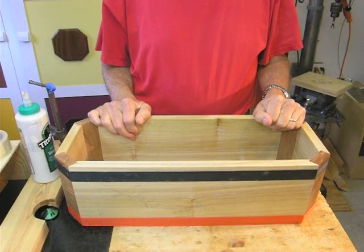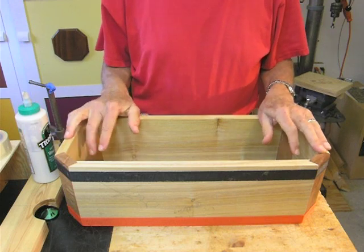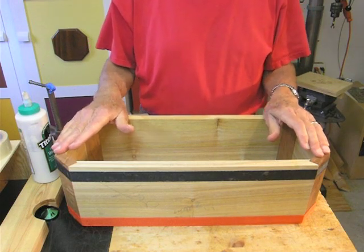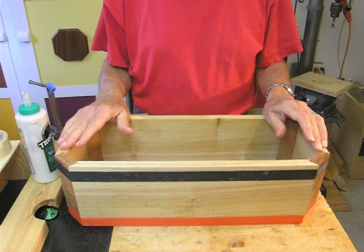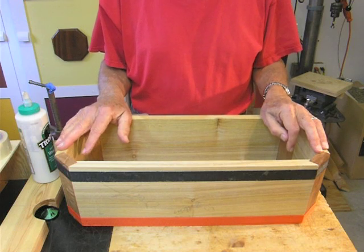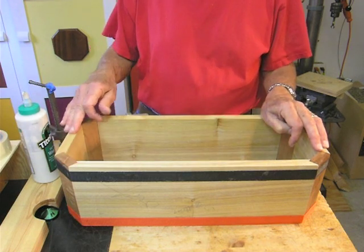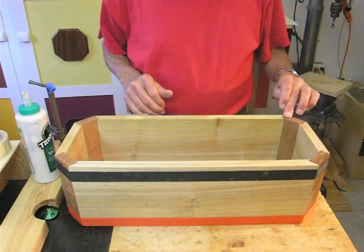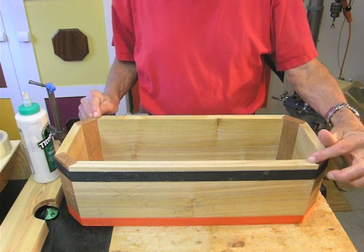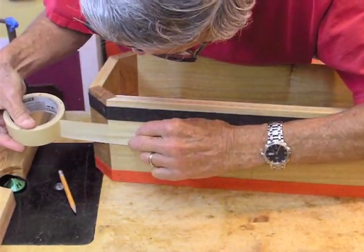Let's talk about the glue-up. The dry assembly shows that everything fits, so how do we put it together permanently? If you are fast and accurate with placing the glue and the piece is small, it is possible to do it all in one step. But that can be disastrous if there are unexpected slowdowns — the glue starts drying before you are ready to assemble and the parts no longer fit. In this case, I will use three glue-up steps, as is easily permitted by the bird mouth joinery. We will first glue together half of the body parts — these four — then the other four, through the bird mouth joints. Then we'll finally put the two halves together through the remaining bird mouth joints and insert the bottom at the same time. What I am doing here is taping together the two sets of four body pieces.